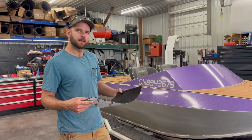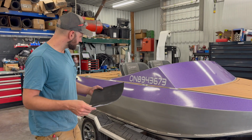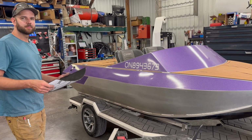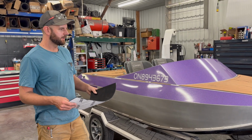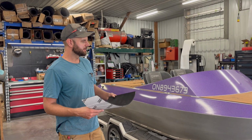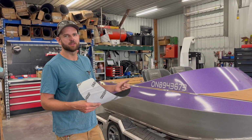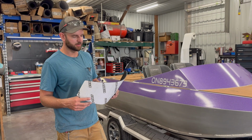And I guess the one special note is the engine cover. We talked about covering it in bilge coat material or some sort of epoxy adhesive because it doesn't like to stick to the raw CUSA. Yeah, and again, I would recommend if you're going to stick this to something besides aluminum or that coated CUSA to do like a test piece, just to make sure that long term it's going to stick well.